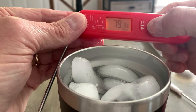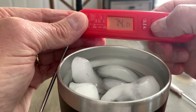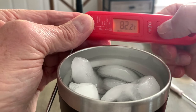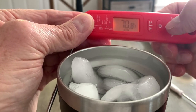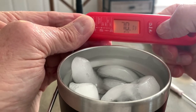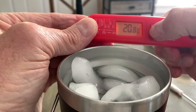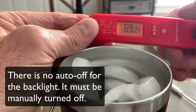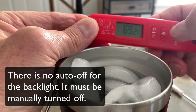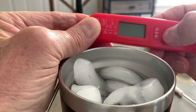Another press will get it back to reading the temperature. A quick double press will tell you the maximum temperature measured since you turned it on, and then a single press will show the minimum temperature recorded since it's been on. A double press will turn that function off. You've also got a Fahrenheit and centigrade button. The backlight goes on automatically when you turn the thermometer on, and a triple press will turn that light off. When you turn the unit off and back on, it shows a battery level indicator.